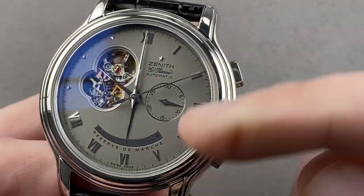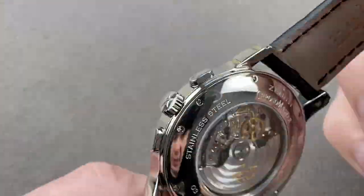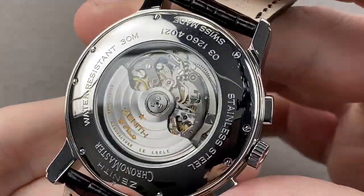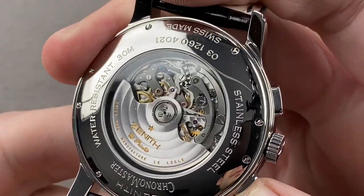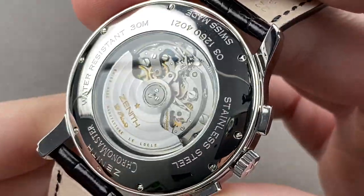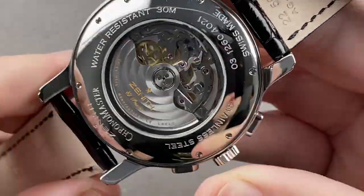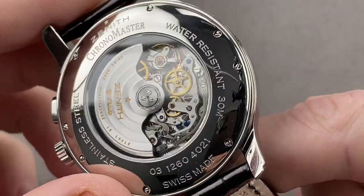Now, the watch does have a 52-hour automatic winding power reserve and a wonderfully crisp column wheel El Primero movement. Of course, the El Primero beating away at 10 beats per second since 1969, the original automatic integrated high beat chronograph caliber. And it's still a great looking one, as the lateral clutch and the column wheel are beautifully visible and flies away at 36,000 vibrations per hour. So it has a lovely double step cadence against the ear.